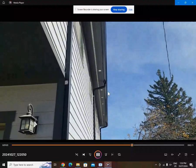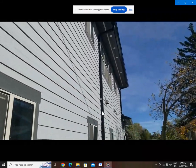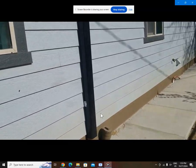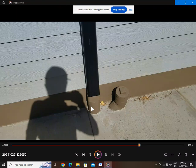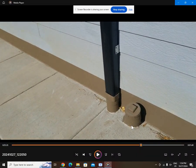My downspout drains are all going to that side. I've got another downspout drain right here — maybe that's redundant. They say you only need one downspout every 40 feet, but it's my house. If one gets clogged the other will still work. On the clean-out here I did it a little bit different and I don't like it this way — I wish I would have done it the other way, closer. But it was already glued together. Just do something where you can get your snake through there without disassembling your downspout. When I did the concrete I got all the sealant around there so the water doesn't get in and freeze and break the concrete.